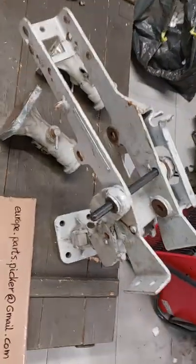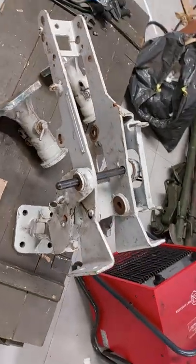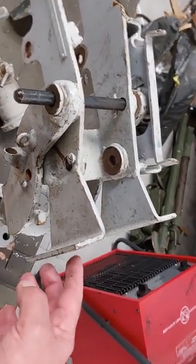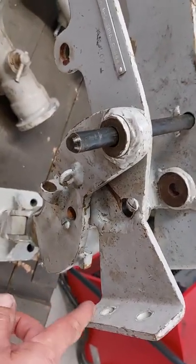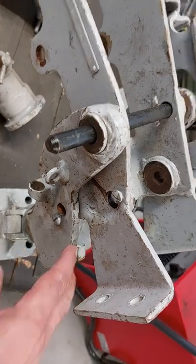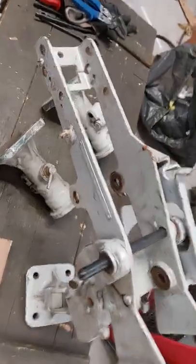Keep it in mind — it's the 50 caliber cradle Mark 18. If you do a search on the internet you'll probably find out how rare these are, because the only ones I could find were Mark 19 cradles. This is slightly different. The connection of the armor plate comes up here — it's put in place with four bolts and four nuts. If you have the Mark 19 cradle, the armor plate is connected or welded on the fork.